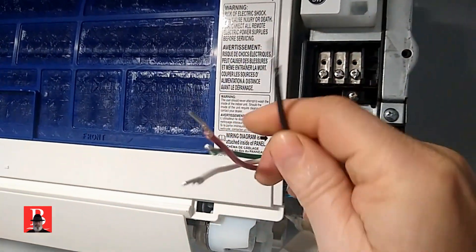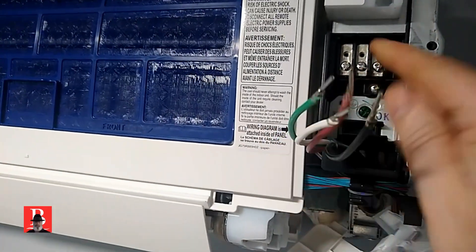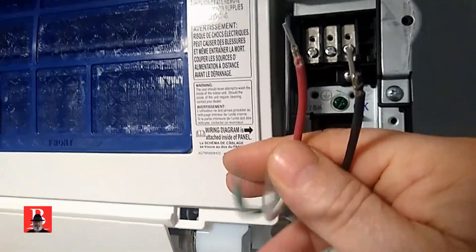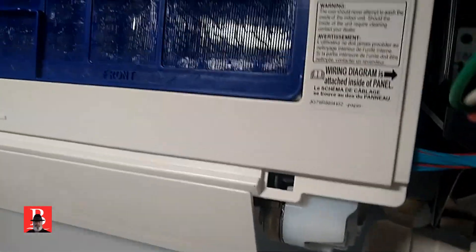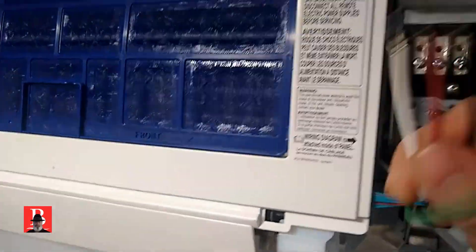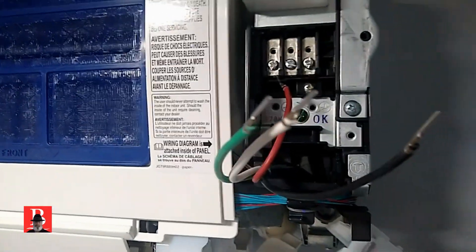You see the cable here? This has pin connectors. You see this? Terminal strip. Pin connectors. Terminal strips. One of these things is not like the other — one of these things just doesn't belong. So we're going to cut these off and replace them. I've already got a terminal that we'll put on here, put a little shrink tubing on it, and we'll go right up there. I'll show you in the next clip.